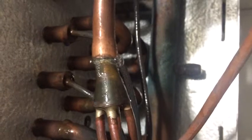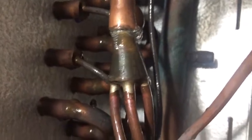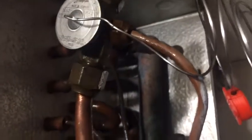I'm gonna have to go pump her down and get the torch rig ready, dryers and all that good stuff, but we found the leak on this walk-in box here, and I'm kind of stoked, so